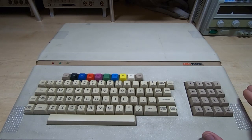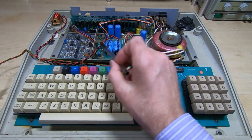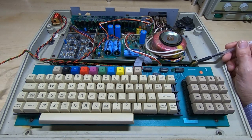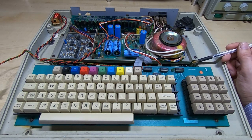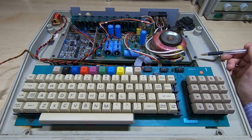This doesn't work, so as ever we'll get the cover off, have a look at it, and see what may be involved in getting it repaired. With the cover removed we can see how it's laid out inside. We've got a nice big beefy power supply running across the top. I'm a bit concerned - there is a lot of corrosion in here, and with the age of the machine and the type of PCB, there may well be a lot of corrosion on the PCB as well, in which case it's possibly not going to be repairable. This is quite a nice layout for a machine of its time - a lot of machines of the early to mid-80s were very poorly laid out and made them very hard to work on.